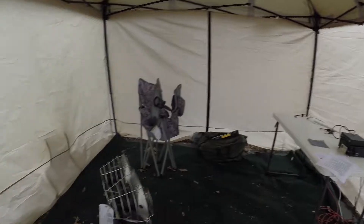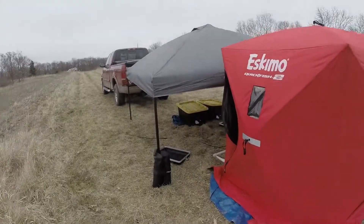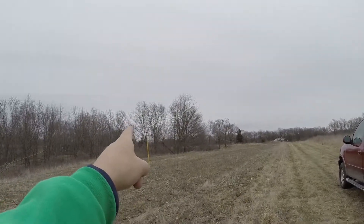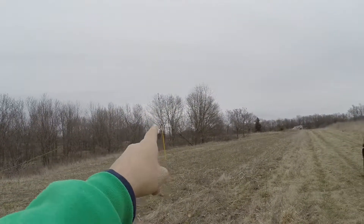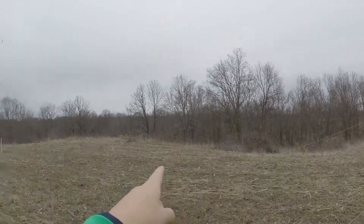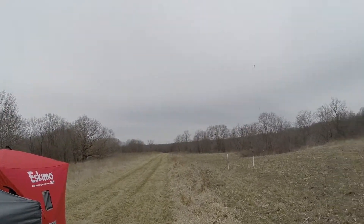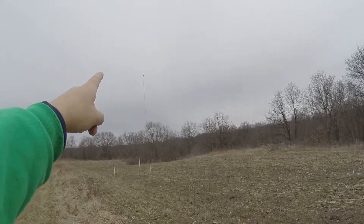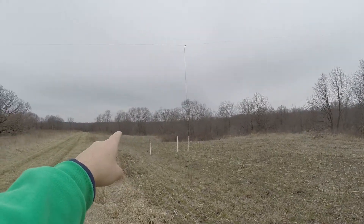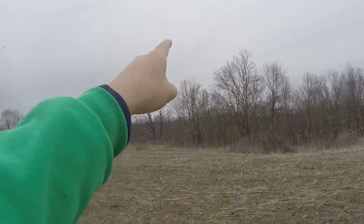That's where he operates from with his big heater. Here is my station. I've got my truck backed up, here's my camp, and I've got my inverted-V that runs 40 and 80 about 15 feet off the ground, fed by a 75-foot coax. Then I've got my 40-meter Windom that is strung up probably 25 feet in the air — the vertical radiator is about 30 feet, so maybe it's about 20 feet up, strung up in the trees.